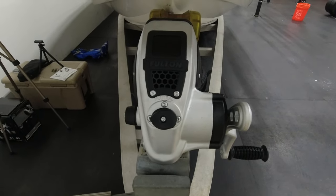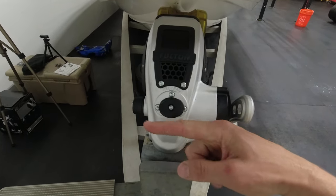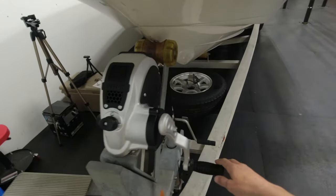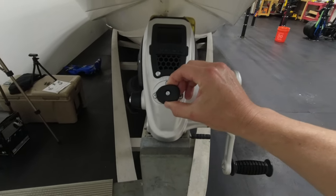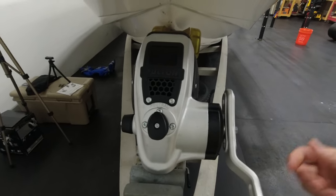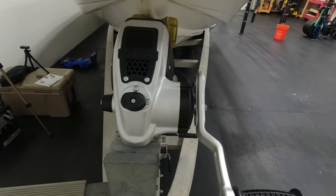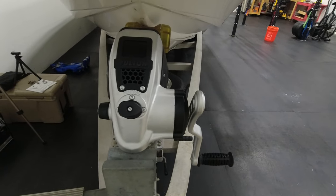Okay, at this point it's done — it's in, it's installed. As it tapers to nine o'clock and I pull the handle toward me and roll up and over toward the boat, it will draw the winch in. If I pull this tab out toward me and turn it up to 12 o'clock, that's neutral — it's in free spool and can spool in either direction. If I pull it out and turn it to three o'clock, that gives me a controlled descent to let the winch out.